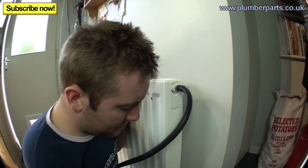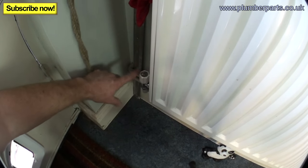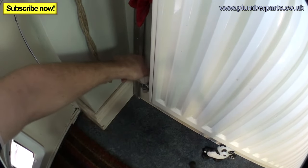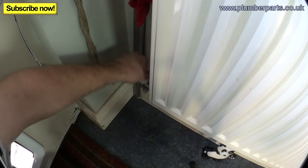Got a little bit of air in there. That seems to have cleared now and it's quite warm, so we'll shut that end. We've shut the TRV and bled that bit of air — now we're just going to do the lock shield side at the other end. A couple of blobs of air coming through there, and it's coming through nice and warm now — that's great.